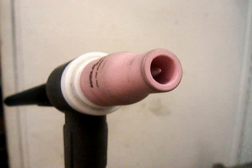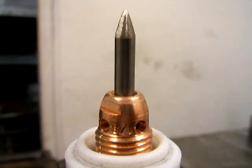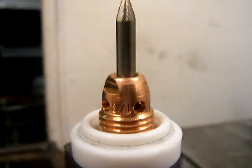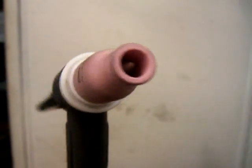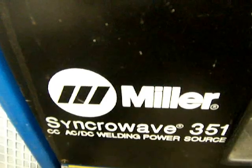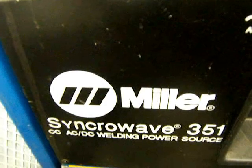If you're going to do it, here are some tips. Use a big electrode and recess it back below flush. In this particular demonstration I'm using a 1/8 inch 2% thoriated electrode with a small number 20 style TIG torch, sharpened to a kind of blunt tip and recessed back below flush — maybe not quite an eighth of an inch. I want to be able to drag this along just like a drag tip on a plasma cutter, using a straight edge or something to prop on and just drag it and cut.